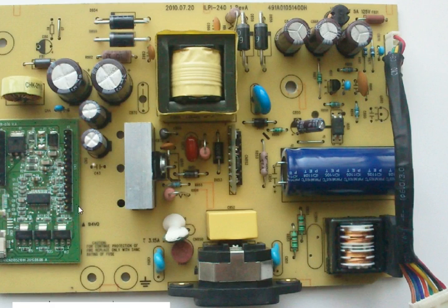The first part of the circuit is where the AC comes in. It goes through this fuse right here and eventually makes its way down to the bridge rectifier, where it's converted from AC to DC for the first time. This section is what they call EMI filtering — it stops you contaminating the mains with any high-frequency signals, and stops the mains from contaminating your circuit if there are big motors or anything on the house mains.